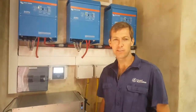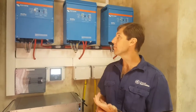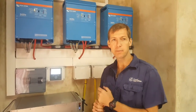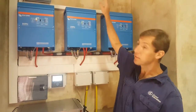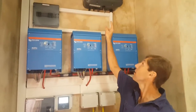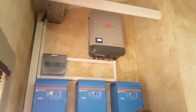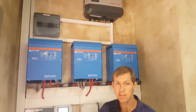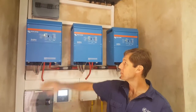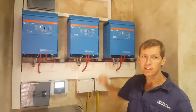Morning, I'm Craig from Current Automation in Ellsbury. What we've installed here is a three-phase system to back up Megapaint's paint shop in Ellsbury and to provide them a reduction on the energy bill. At the top we have a Fronius Symo 12 kilowatt three-phase inverter producing a grid-connected solar feed running straight onto the AC bus, which is generated by three Victron MultiPlus 5000s configured in three-phase.